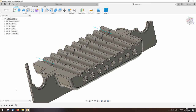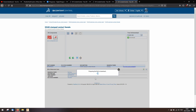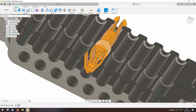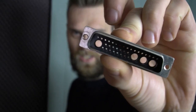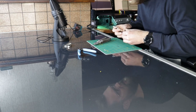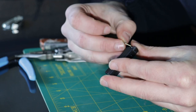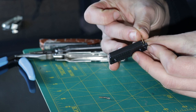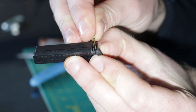This is of course the female connector. I'll insert the female version into the current document. I have a very special connector and to be honest I don't want to cut it in half — but I've got it in half. Now I'm going to check if this will fit, and more importantly, how it fits. The contact is pressed in like this — the diameter inside is bigger than at the entry, and this part is tapered, so it's a collar. That's what I'm going to design.